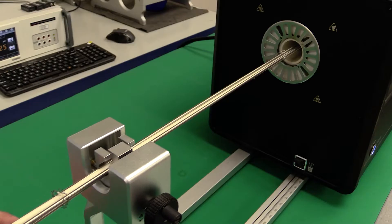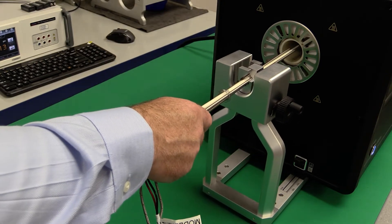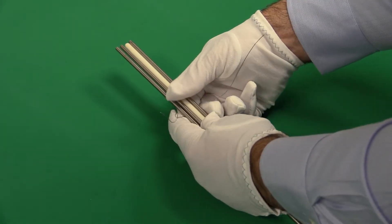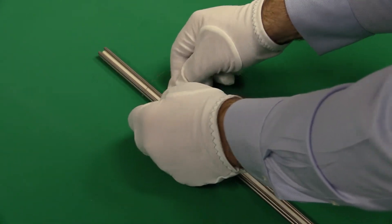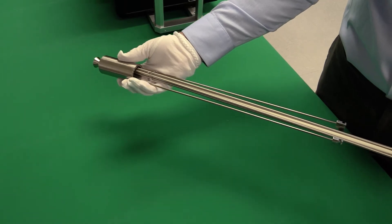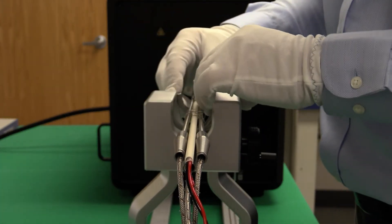To calibrate a large batch of thermocouples, you might choose to select the empty chamber mode, which gives you the highest probe capacity possible. A common calibration method is to bundle a number of thermocouples under test with a Type S reference TC, placing the Type S thermocouple somewhere near the middle of the bundle. The ADT850 with the cup design allows for easy loading and positioning of this method in the furnace.